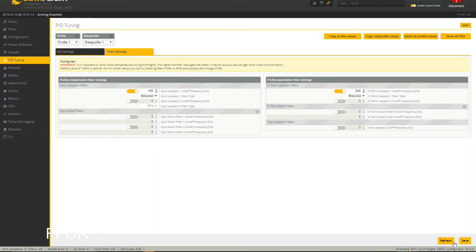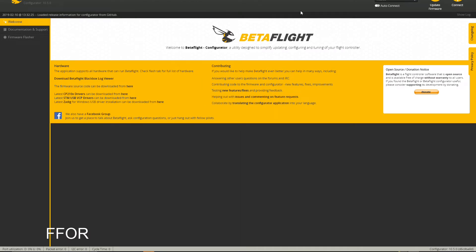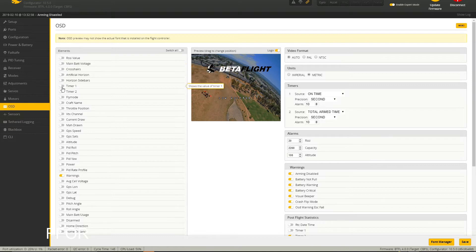And that is going to be it — but I'm also going to show UAV Tech's newest Betaflight Configurator version. We disconnect here. The newest version is an app you can download and sideload — it's not in the Chrome store but it is really good. I configure it at version 10.5, the main reason being it has different OSD options. I care about fly mode, craft name, throttle position — I like those.